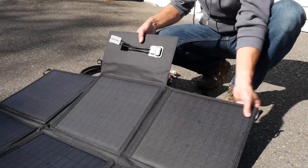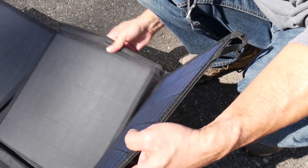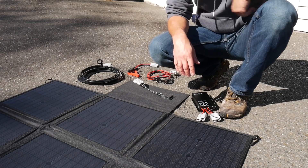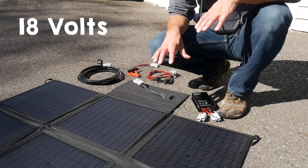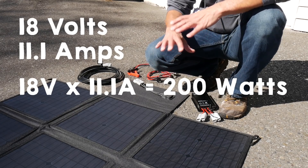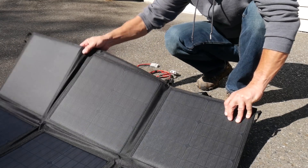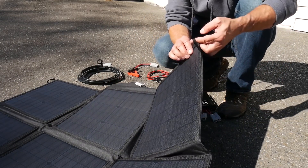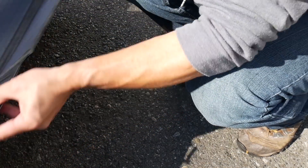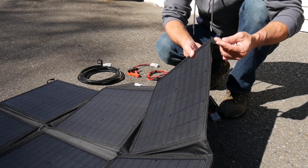The panel itself — you can just use this all by itself. It looks like there are 12 of these individual small solar panels on there, all connected in series to give you this 200-watt output. The operating voltage is about 18 volts and the operating current is just over 11 amps. Pretty handy, pretty versatile — you can move it around and it conforms to a lot of different surfaces. It also has these little loops on the sides, about four on each side, that you can use to hang it on something. I'd like to see these be a little more heavy-duty — I'm wondering if they'll wear out over time.